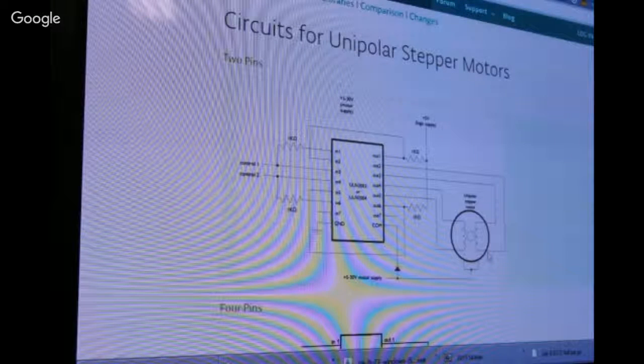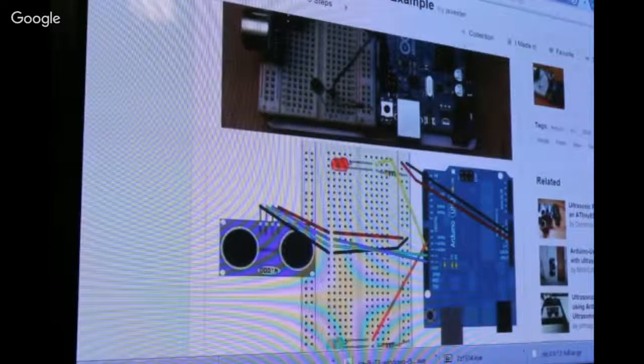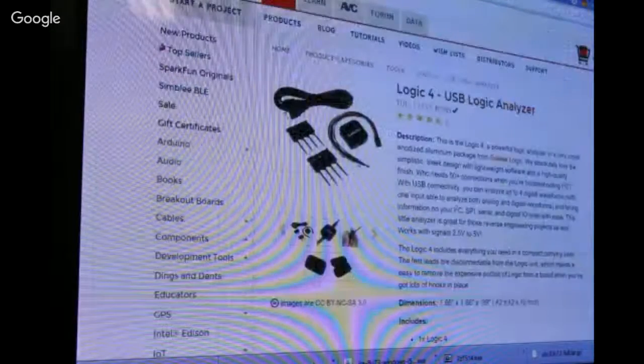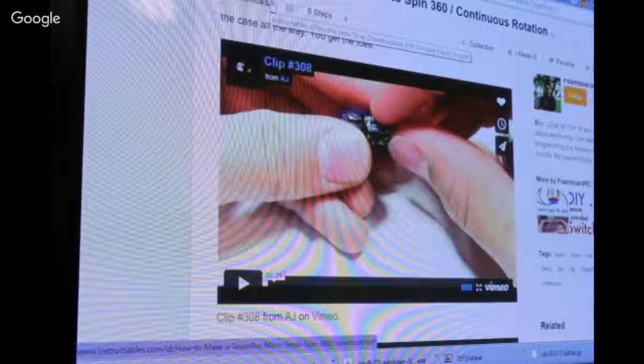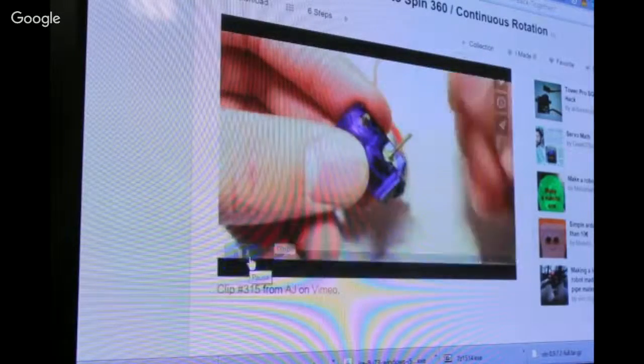These servo motors are actually limited to half a turn, so they go 180 degrees one side or the other, but they can't go all the way around. Now, if you take them apart, there's actually a tutorial, and I'll put this in the notes from tonight. I noticed when I put it at 280 and 280, it really hates that in a serious way. Here we go. So, Hack a Tower Pro Micro, which is what this is. There's an Instructable that showed how you actually do that, but it's kind of a silly process.